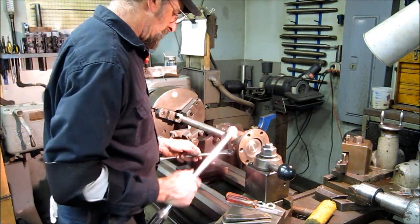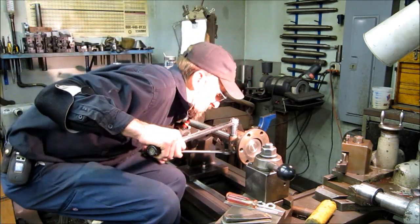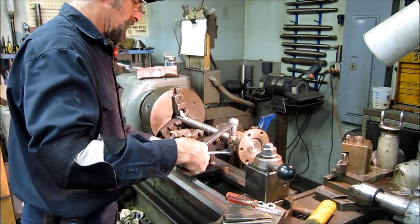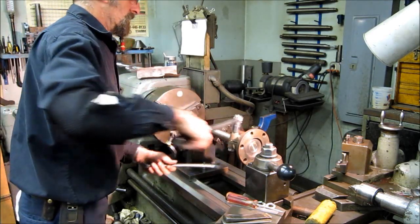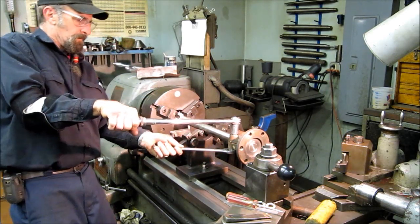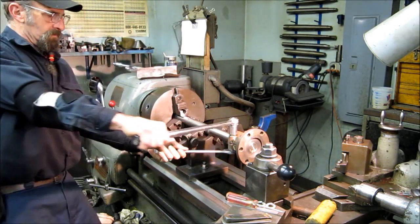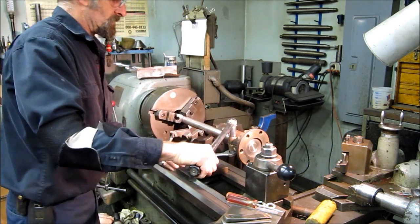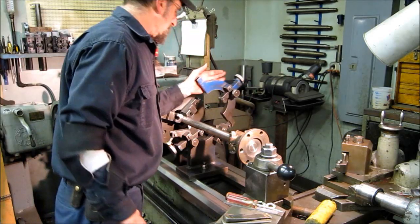Alright. Stand in the same position, okay? Now if you're in the bilge, you're going to be in this position, okay? I understand that. I've been there. All I'm trying to do is make sure, whatever position you're in, you're bringing them down using the same feel. You don't want to tighten one more than the other. Alright, now she's ready to face off.